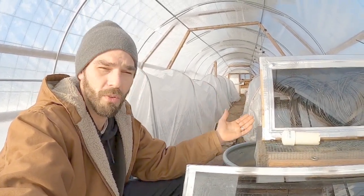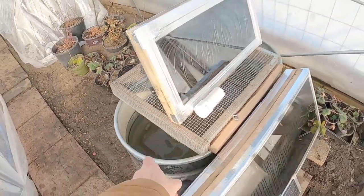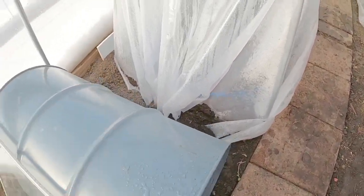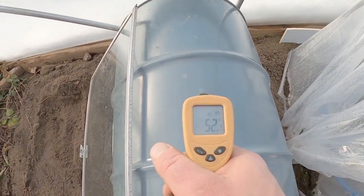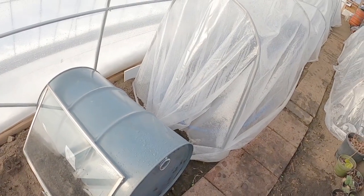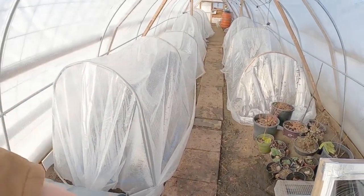Now I want to take some temps from our little solar water heater and then check out the build on our solar air heater. We've got a little ice on here because it got cold and I've been throwing snow in here. I used our little pump to pump water and fill this 55 gallon drum — we took most of the water out of the tank and filled it in here. This is holding some decent heat and with this little recycled window on there it's definitely pulling some heat. We're sitting 53-54 degrees on a negative 5 day with a negative 30 wind chill, so we've got a whole tank of water that is 50 degrees. This little recycled window is just sheltering and amplifying the heat and banking that solar energy into this container along with our PEX tubing basically holding all that heat in the floor.